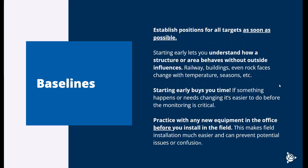I also want to touch on the idea of baselines — establishing positions for your targets as soon as possible. That way you can understand the natural behavior of whatever you're monitoring, especially prior to any reporting. With railway buildings, rock faces, changes in temperature and season, these can have huge influences on the variations you see. Understanding that before everything starts is really important. Starting early also buys you a lot of time, as there are always going to be changes you need to make.